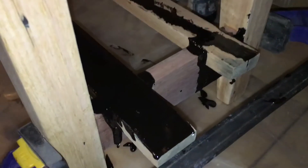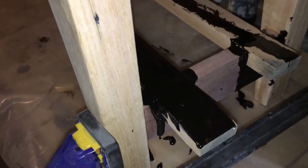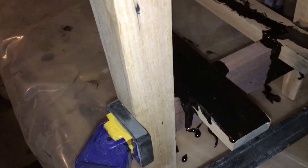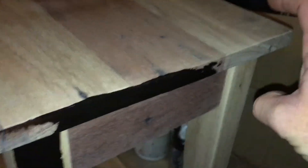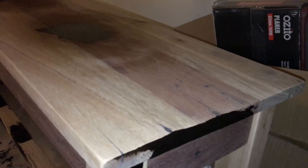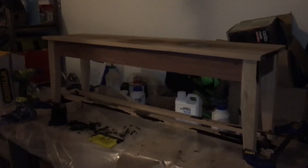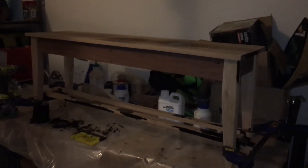These plugs will be sawed off flush with the rail, and they'll get a screw each through the top and then plugged. Same here — a screw hole and a plug in the opposite color on both sides. So there it is: sanding and plugs, then oil finish.